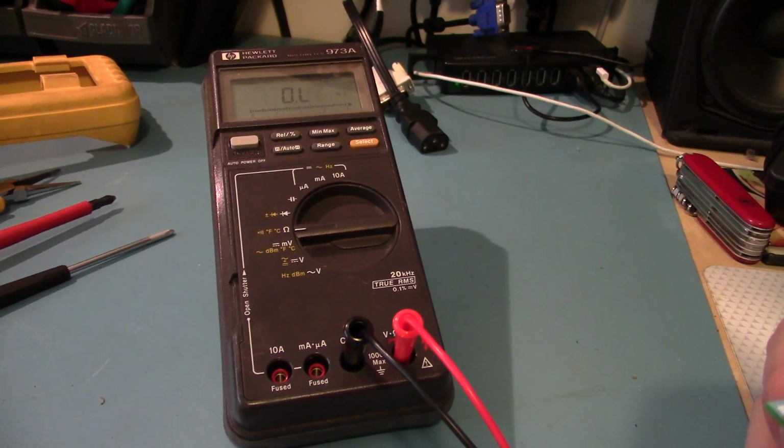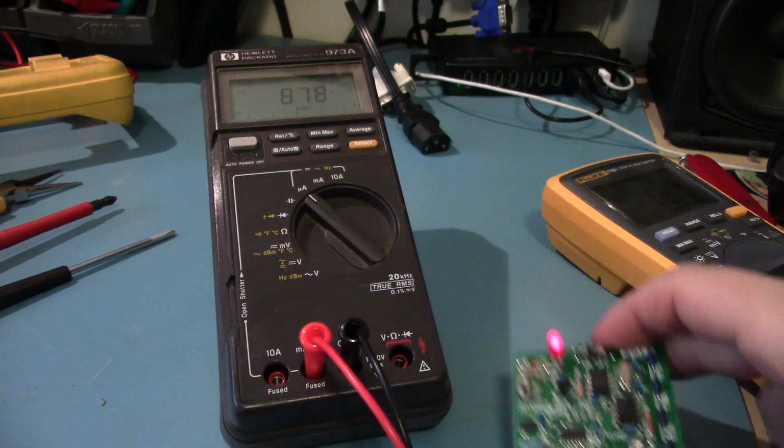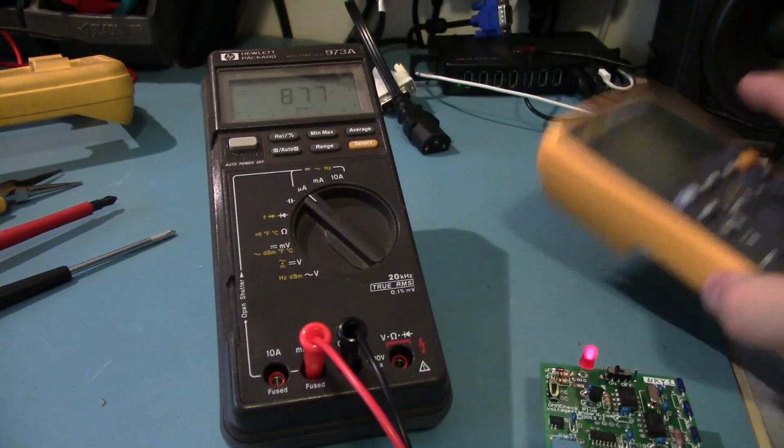And 100 ohms. Oh, this one's a little high, actually. On my sheet it says it's 99.995, so that's a little off. Just trying it on the amps range, and on microamps it's not dead on like the other ranges.